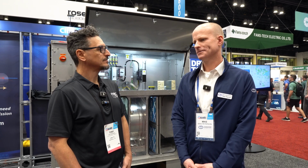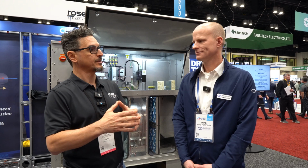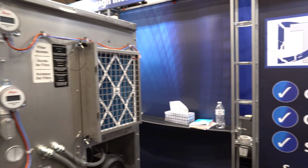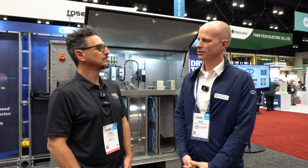Still dry relative to the mechanical cooling dehumidification industry. And I like to take a psych chart and draw a line at the 45 dew point. Anything under that, you're probably either all desiccant or at least some desiccant. Sometimes you could do a chilled water job at a 40-degree dew point, but then you have some desiccant product doing some kind of removal. You end up with a little bit of sensible heat in the air, but that's the easy thing to remove, other than the moisture. There'll be certain applications where you might have a lot of the air going through the desiccant wheel, but not all of it, for that reason.